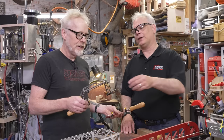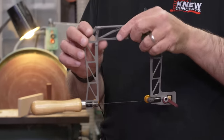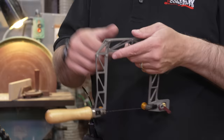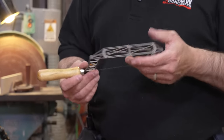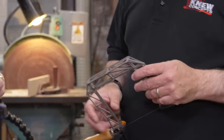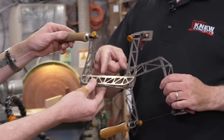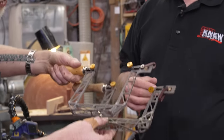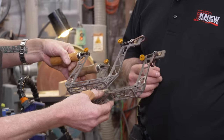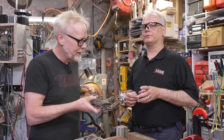Eventually they stopped screwing up, so we ran out. So you were buying the seconds from the QC from the Air Force — it failed QC. It was perfectly fine for hand saws, but it wasn't good enough for an F-22. So you were leaving a lot of titanium on the table. Yeah. And suddenly we had to pay full price at retail, and that needed to stop. So the way these guys are put together is the legs are cut right next to each other, and the spines are all cut next to each other in a different sheet — a lot less wastage. You brought this last time, didn't you? No, actually I didn't. This is amazing — this is your prototype. That is the original birdcage. And clearly you went from TIG welding to riveting, which I think is a lot more sensible.